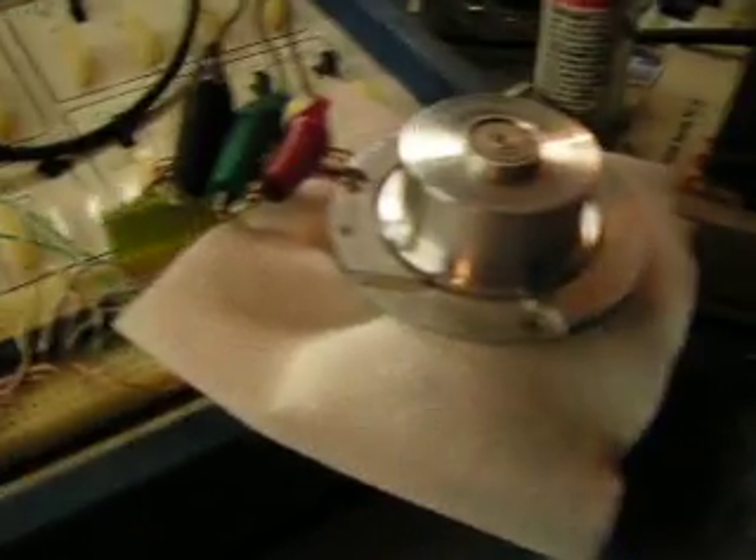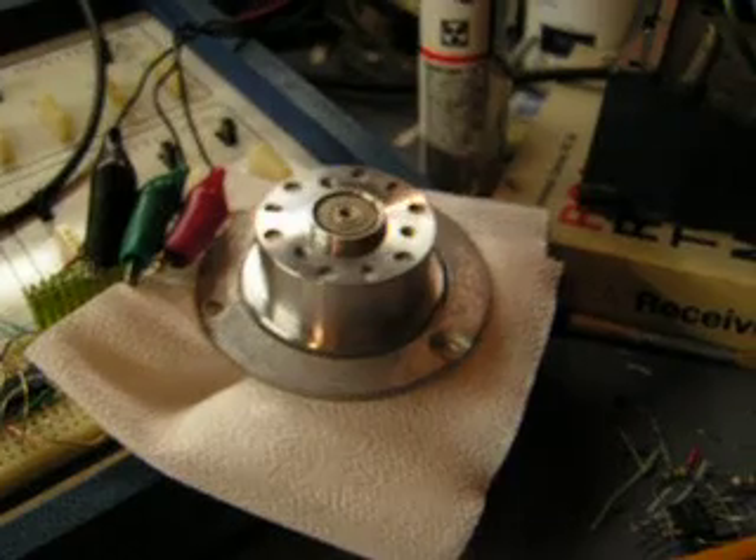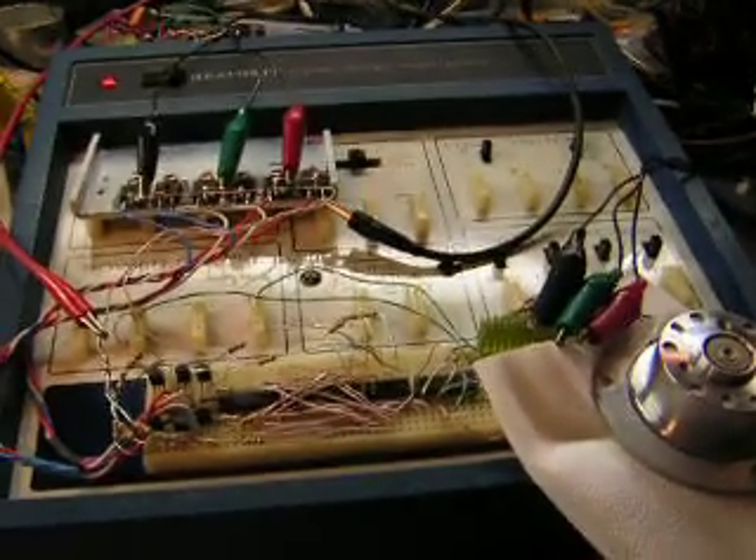So it's a pretty cool motor. When we turn it off, it keeps the power supply charged for a little while through the body diodes of the MOSFETs. It makes a not bad little generator. And that's it for today's project.